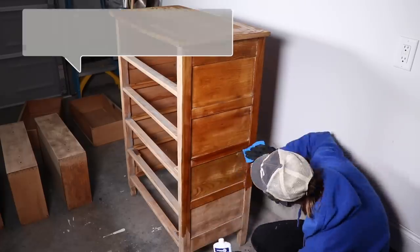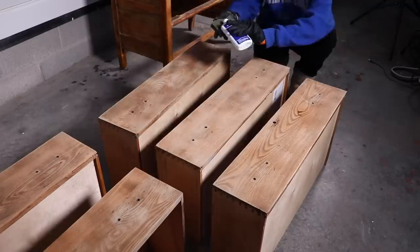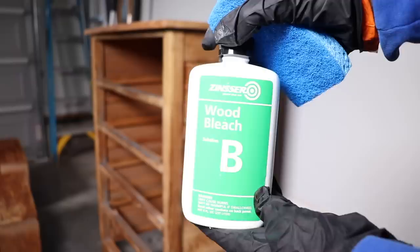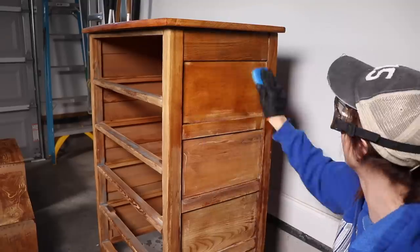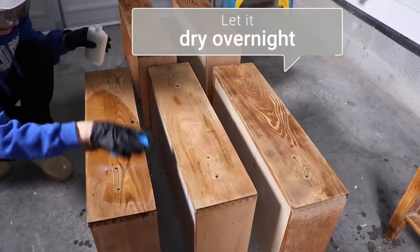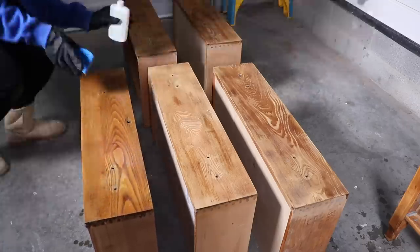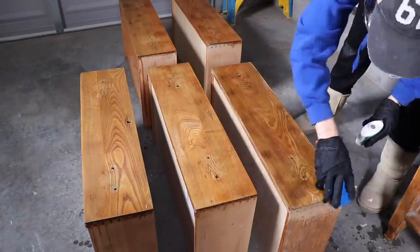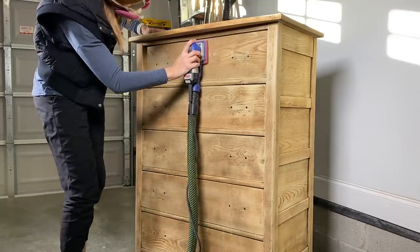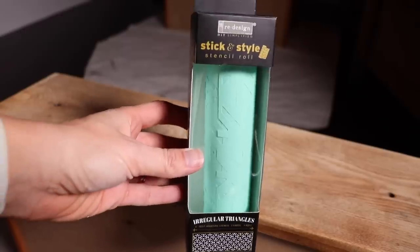You want to saturate the entire piece with the A solution and let it set for 5 minutes if it's softwood and 10 minutes if it's hardwood — oak is hardwood so I let it set for 10 minutes. Make sure you put enough on so it's still wet when you apply solution B. Mine was a bit dry, so I think I needed more bleach on round A. After the 10 minutes, I applied solution B with a clean sponge and then let it set overnight to dry completely. If you want it lighter, you can do a second round, but you must neutralize with vinegar first. I was happy with the results and moved on to a light sand with 220 grit to remove the gunk the bleach kicks up.